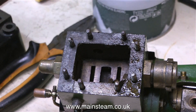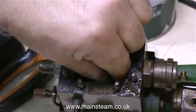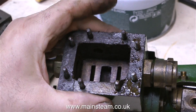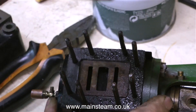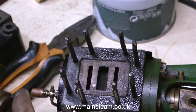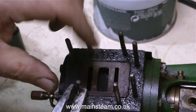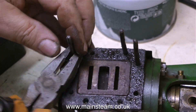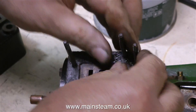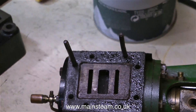I wondered what I was going to find inside the steam chest. What was the state of the port face going to be like? The first thing I found was a slide valve and four lock nuts, which is pretty good - I didn't expect there to be anything in there. Once I remove the steam chest, I can see the port face clearly, and it's in very good order. I really am getting more pleased with this by the minute. I'll remove the studs so I can get at the port face. When I cast my experienced eye on this engine, I could see the potential in the machined parts underneath the horrible paint, but it was more down to luck than good management, really.